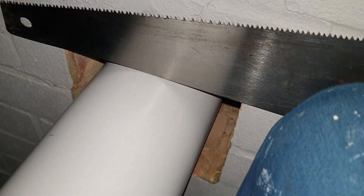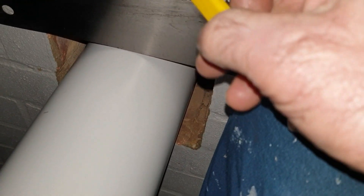Push the flue through your opening in the wall. The black piece has got to go into that socket at the back, all the way in to make sure it's home properly. Get that in there — I've put my saw so it's poking out the wall. All the excess is there; I want to mark out where the wall is, so I put my saw against the wall.